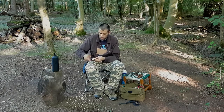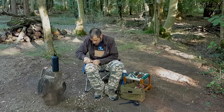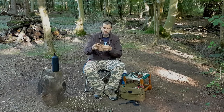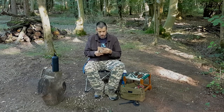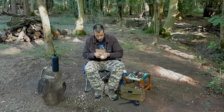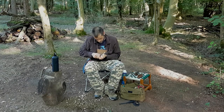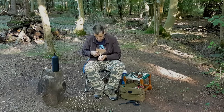You could just carry on working each ridge line off until you end up with a nice smoothly rounded bowl. I find with these five facets, because they're quite subtle, there's not enough of a hard edge on them to be uncomfortable in the mouth. It looks quite nice, so I'm quite happy to leave those behind — it's a bit of a preference of mine to do that. I'm just going to blend that one in all the way back in this case. Sometimes I stop it around this point, but because of the way this is carving, I'm just going to go straight through.